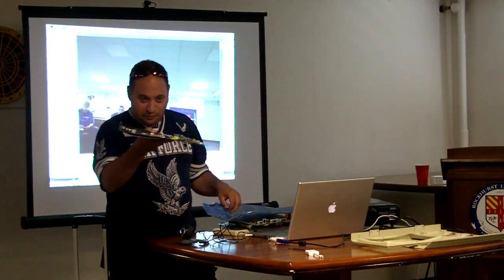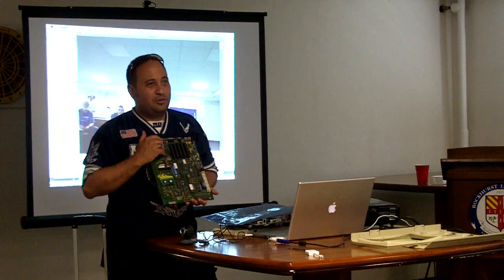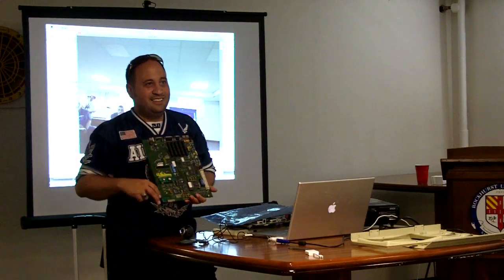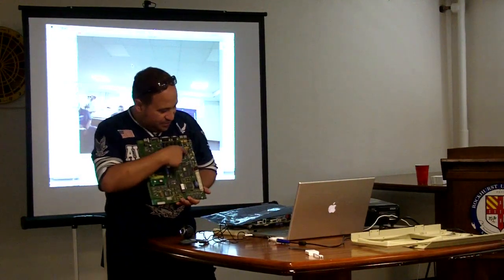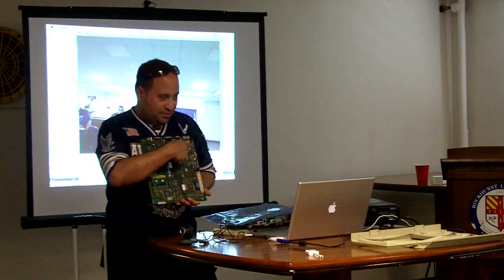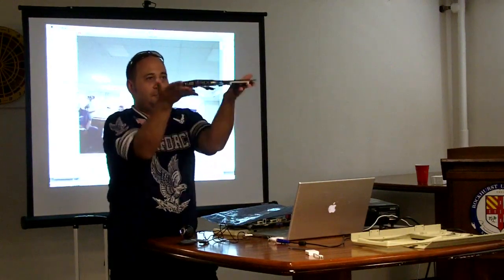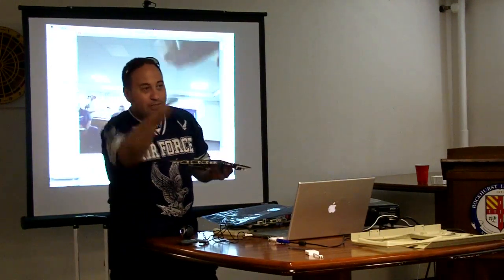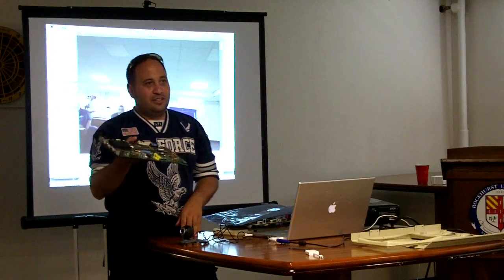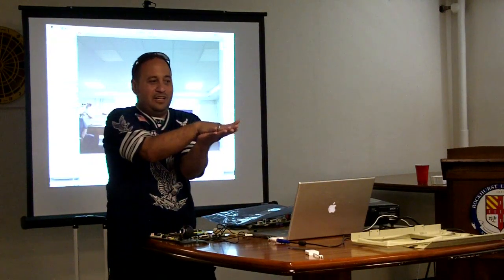I'm not going to pass that around because it's got this flat window on here. This is what happens when you go through. This is a Mark Twain motherboard. It goes all the way through all the engineering to make the motherboard. 3 ICs, the SCSI chip, part of the SCSI logic, and the sound chip, were put in the CAD program backwards. So they're on a different layer on the other side, so the part got dropped backwards. The auto router routed it backwards. So when you went to put the IC on the motherboard, pin 1 was over here, and it needed to be over here.